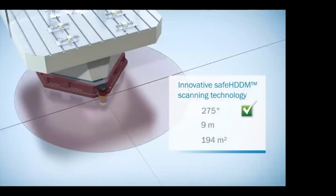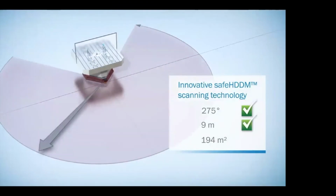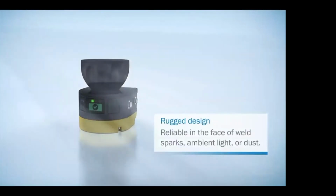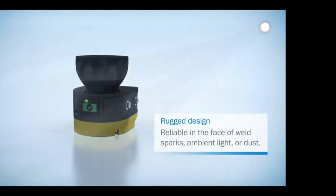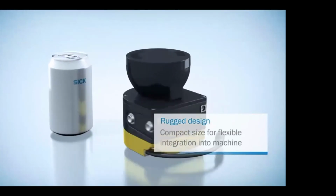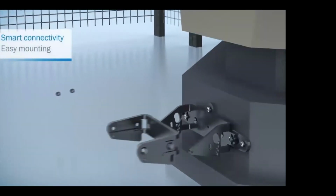Now to do it a different way, we use safety scanners called the microScan that has 9 meters of protective field and 275 degrees protected. We use a technology called HDDM, which is high definition distance measurement. We're able to ignore sparks, ambient light, or certain dust particles when in operation. These safety scanners are now very compact in size from before. They're about the size of a pop can.